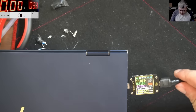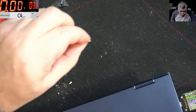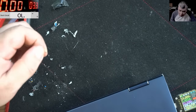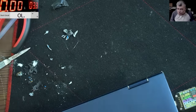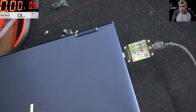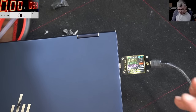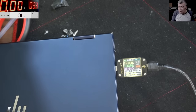Proper solid. Yeah. So the issue was this wire, which was broken. You remember the blue wire? Blue wire, which is actually the data. I believe it's the data. Yes, it is. Okay. So that's how you fix a charger. And this is the most misinterpreted fault. I mean, it can easily lead you to believe the ports themselves are faulty when actually you have a faulty cable.